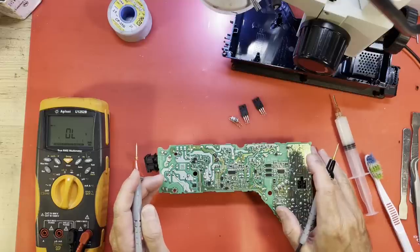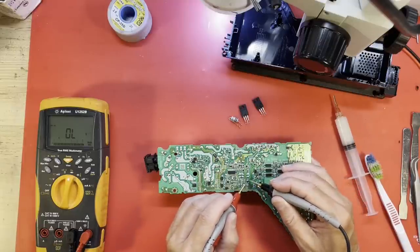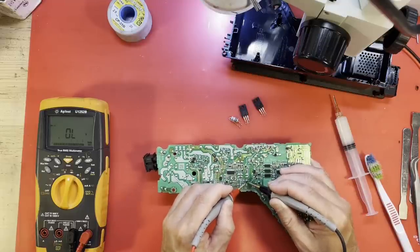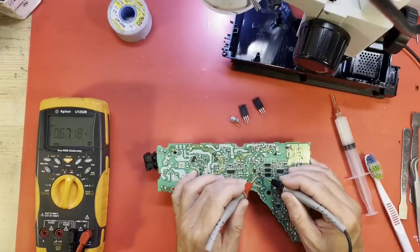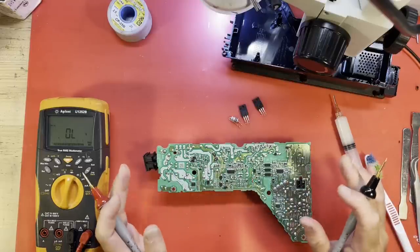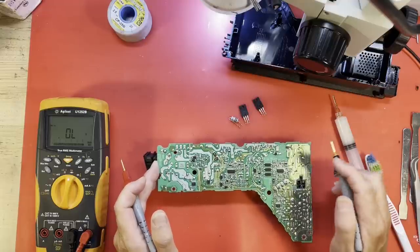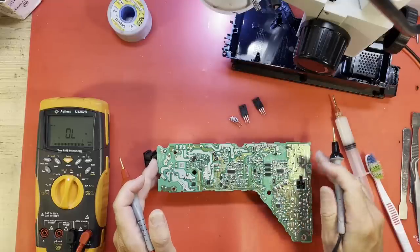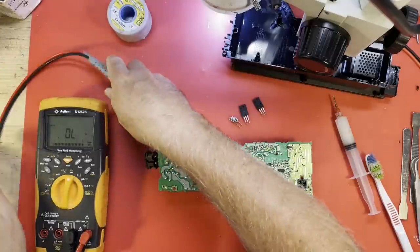Anything else? This little MOSFET down here, Q34, has been troublesome in the past. But today seems to be perfectly fine. It's not shorted. That's good. Kind of expecting very light damage on this one. I mean, there's no burn marks that I noticed. I think something stepped in the wrong spot and turned on our MOSFETs hard, and they shorted and opened the resistor. That's what I think happened. Let me get those MOSFETs replaced, and we'll go through our diode checks again.